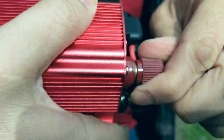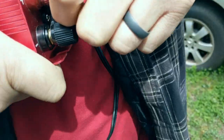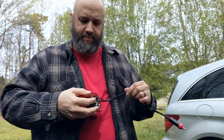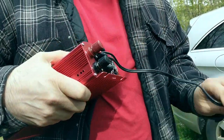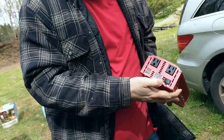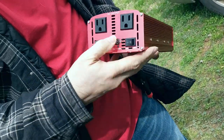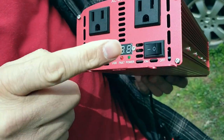You want to get it tight because you want the contact to be tight. If you don't, there's a chance for arcing — the electrical charges may not be touching correctly, and electricity will try to arc to make contact, leaving burn spots and potentially lighting things on fire. Make it really tight — hand tight — but not so tight you're ripping it through. Don't use a power tool. It came on with a fault indicator, but the directions say that's fine.